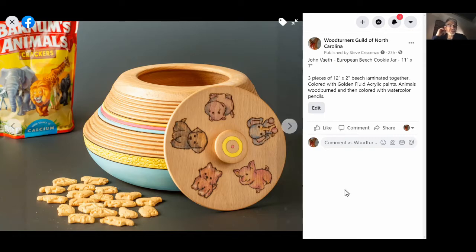John, what did you do with the yellow band, the texture on there? Maybe you said it, but I missed it. It looks like orange peel. No, lemon peel. It was just a micromotor tool with a little round bit on it. You make a bunch of figure eights or S's in it, and then just draw a few lines through the S's, and it creates kind of an interesting texture. Yeah, I like it. And then the black lines that are kind of the borders of that were burned in with just a hot wire on the lathe.